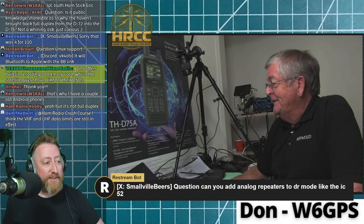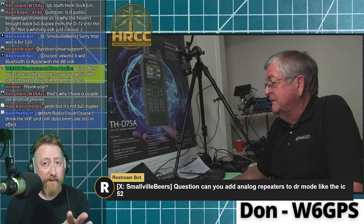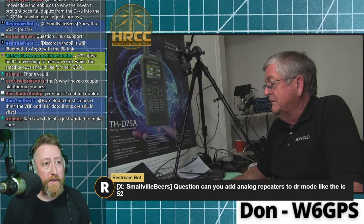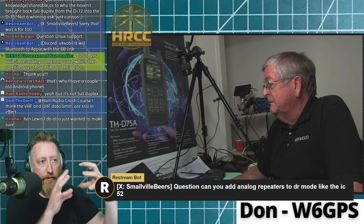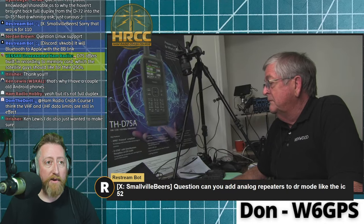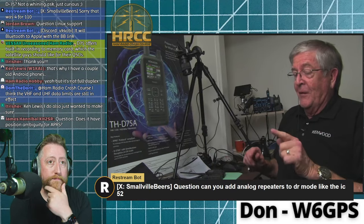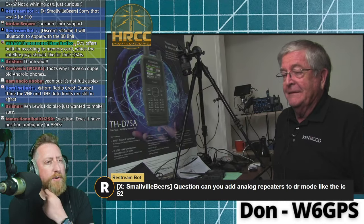No, it's not. If you go to the website dstar-info.com, the D75 shows up as a list of downloadable repeaters. You can download that file, add it to the radio, and it will use that to search through its list of known repeaters. When you are in DV mode, specifically the DV mode where you bring up the special DV menu, you can hit scan, and it will use your GPS to show the local repeaters in your area. So yes, the Kenwood does do this, which is fantastic news, because that means you are also searching analog repeaters while in DV mode. Hold on. Yeah, it cannot search analog repeaters. It only is doing the DV repeaters?